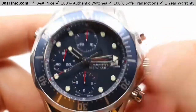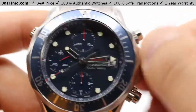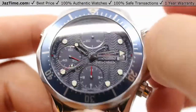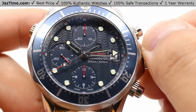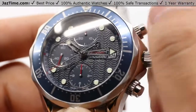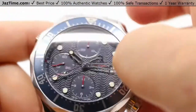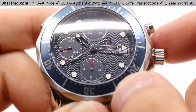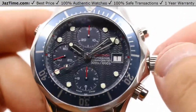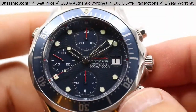While we're here, we can talk about how this works. When you unwind the crown, it has a very light clicking sound to the very first position, at which you can wind the watch if you're at a complete stop — about 20 to 25 winds is all you really need to get it to full power. Pull it out to the next position and you can actually advance the date. As you can see behind that minute hand in the date aperture window, the throw is very sensitive, so if you need to advance the date, say from February 28th to March 1st, be very careful — it takes about an entire rotation to do so. Pull it out to the final position and note that the seconds hand has actually stopped — I've hacked the seconds — so now I can move the minute hand as needed for precise timekeeping. Press the crown all the way back in; be sure that it is screwed in tightly to maintain that 300-meter water resistance.